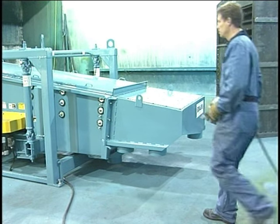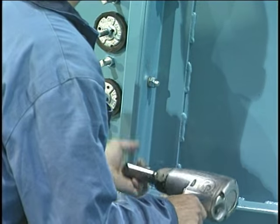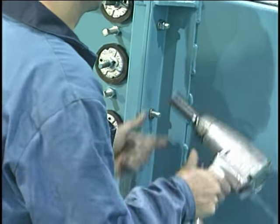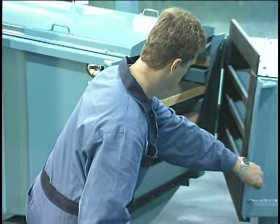Screen removal can also be facilitated on tight installations through the hinge outlet assembly or by removing the dust cover itself. As an added benefit, the hinge discharge manifold can be opened for inspection and can quickly be removed or replaced as required.